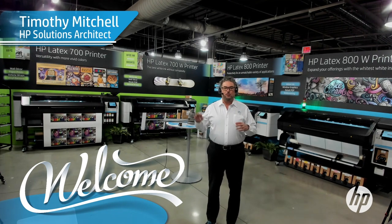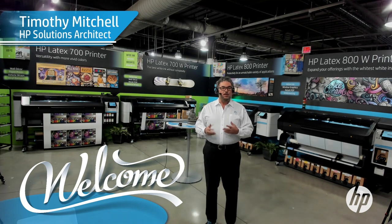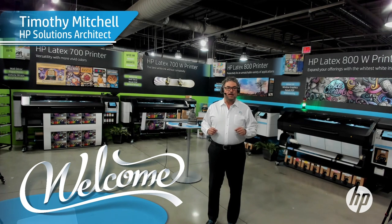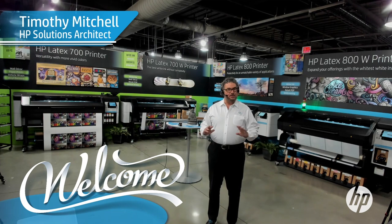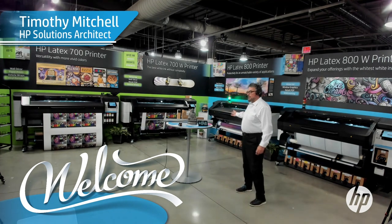If we can get some of the differences out of the way between the 700 series and the 800 series, I think that will help understand them a little better, because everything else they hold in common. Now, one difference obviously is white ink. The 700W, the W denotes white. Same is true on the 800 over here. It indicates that it has the white capability. We add two additional white heads. And keep in mind, when you're running white, you have a white printer, it doesn't mean your six color is any slower. They run the same speed. So the 800 series and the 800W running a CMYK, a poster image with no white, are exactly the same speed. Very key.